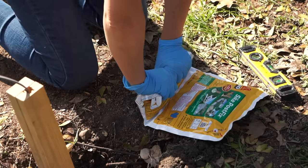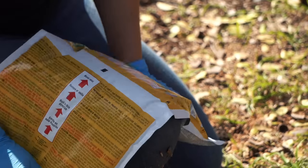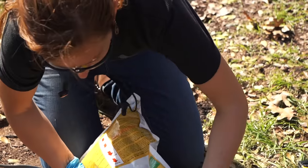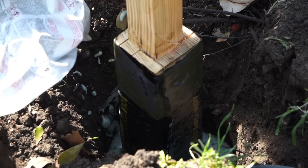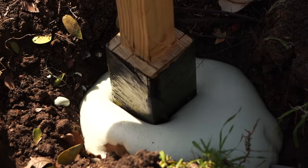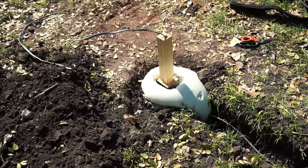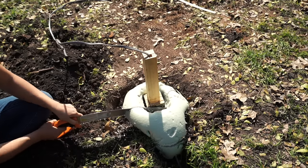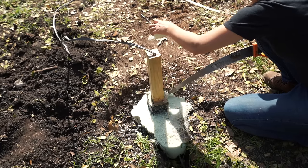I use a groove cut in at the table saw as a hollow core to run up the wiring. Next I set the post in position and start mixing expanding foam to pour in around it. This is my first time using this product and I was amazed. Typically I just mix up a bag of concrete and let it sit for a few hours. This stuff is cheap and found at a local big box store — two components that chemically react to make expanding foam that dries as hard as a rock. After following the mixing instructions I pour it in around the post, watch it quickly expand and rise up, and after about 10 minutes it's set. Then I use a saw to cut it back down to ground level.